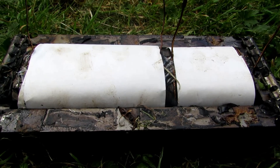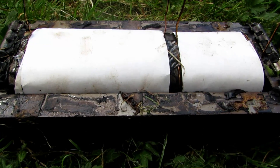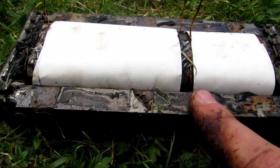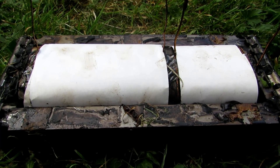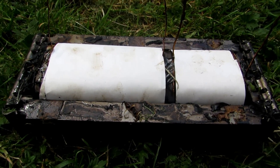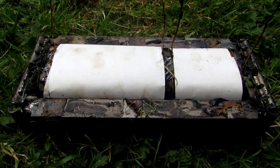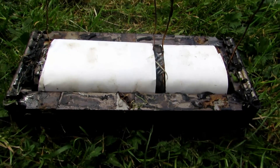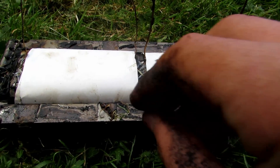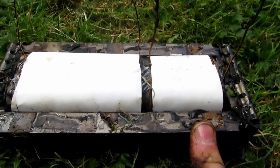I haven't tested this out yet and I will test it out in a moment. I tested with an ohm meter and there are no shorts - the wiring runs right through with a good connection. If you wanted to cool this down faster if it were to get hot, you could stick it in a case, dump a huge amount of oil in it, and pull a vacuum on it. Even a refrigerator compressor used as a vacuum pump would work. Sucking all the oxygen out would leave a vacuum in the gaps, and when you reintroduce air, the oil gets sucked right in and cools everything down. I might do that in the future depending on if this thing gets hot.